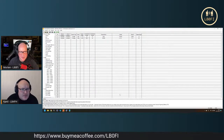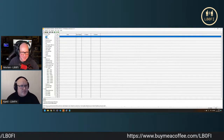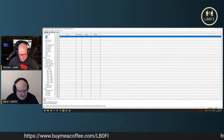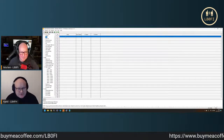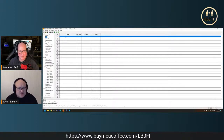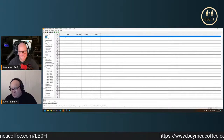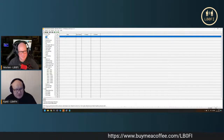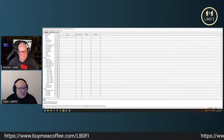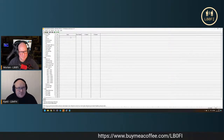Yeah. And now on to zones. I guess that's your next point here. How to use zones. Yep, zones. That's somewhat of a misleading name. I think it's more flexible than being a zone, but it's a list of frequencies or channels. So basically, it's what you think you will hear from where you are. So I usually have one digital zone and one analog zone for the same area. That's my preference to do it that way. I also had one specific for Jamboree on the air.